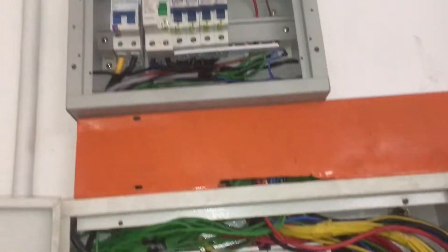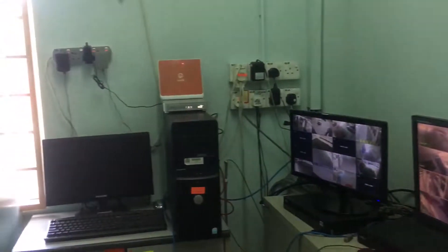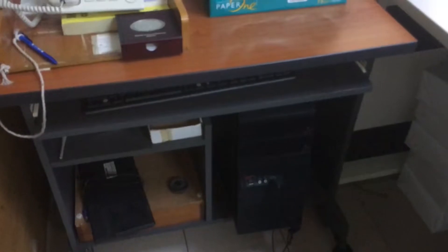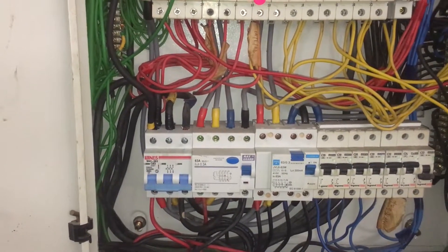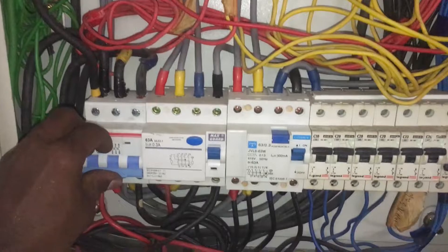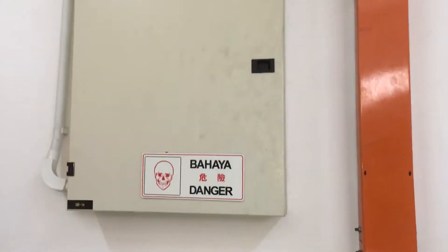For simulation, turn off the three-phase distribution board electric supply. The single-phase distribution board electric supply remains on in the office — the IT server, the internet modem, and the staff attendance system all stay powered, because all those wires are connected to the single-phase distribution board which stays uninterrupted while the three-phase distribution board supply is disconnected. Turn on the three-phase main switch again.